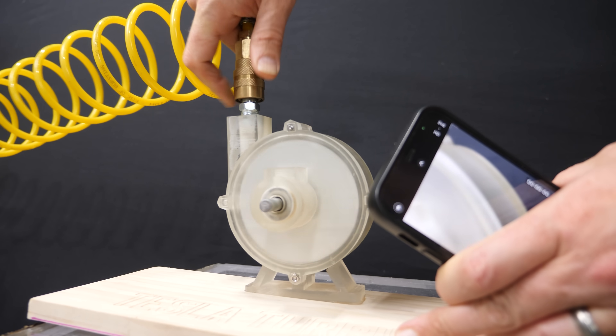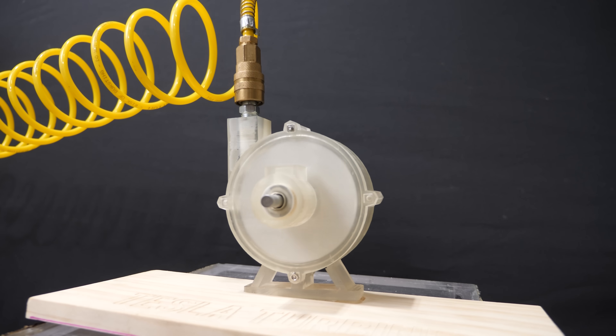And not only that, any minor imperfections in the discs or around the edges makes the fluid become turbulent and the efficiency is also greatly decreased. And even if it were perfectly machined, you still get losses when you apply a load to the turbine because it slows the disc down, and when you change the speed of the disc, it changes the number of spirals the fluid makes before it exits. So in practice, you only get around 65% efficiency for a Tesla turbine.